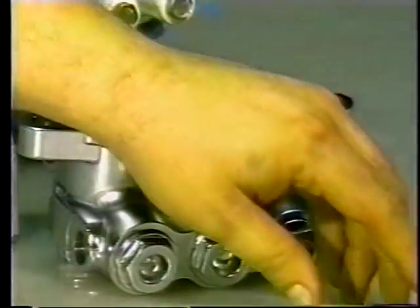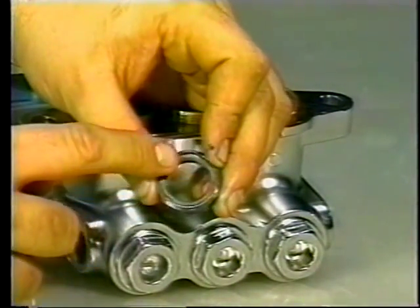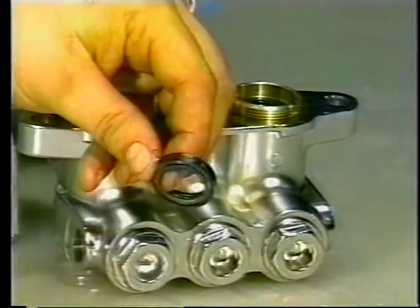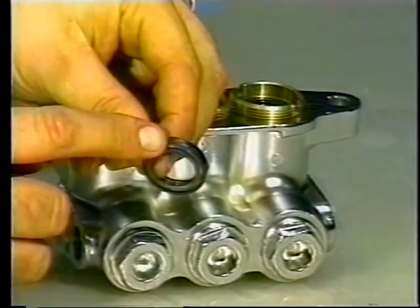Examine the low-pressure seal for distortion or wear and spring fatigue, and replace with a new low-pressure seal. The inside of the new seal is already pre-greased. Apply liquid gasket to the outer surface and insert the new seal into the seal case with the garter spring down.